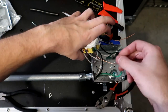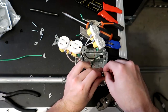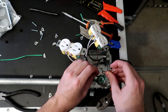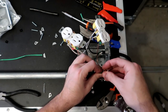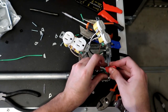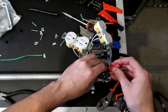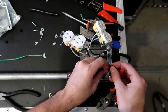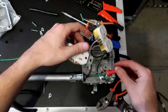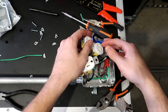Now, with all of our ground wires, we need to basically collect them over into one side together. So this is where some people kind of differ on how to do this, basically how to connect them into the wire nut. The way I do it, basically, is I bring them all together like so. I toss the wire nut on them, and then I make sure that all the wires are jammed up in there properly, which in this case they were not. And then I like to basically just check and see if any of the wires will come out, which none of them will. So now we can tuck this wire nut down into the bottom of the box,